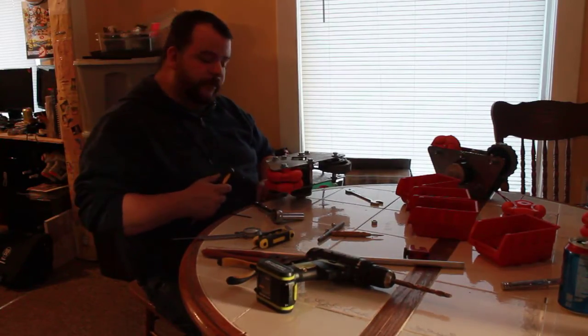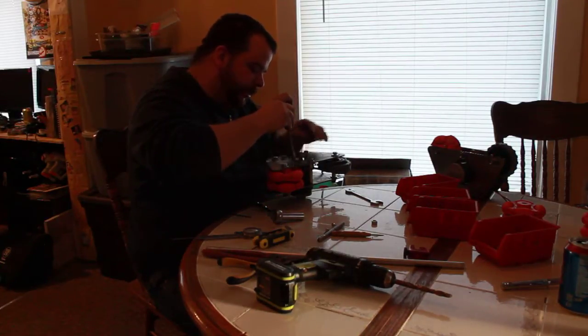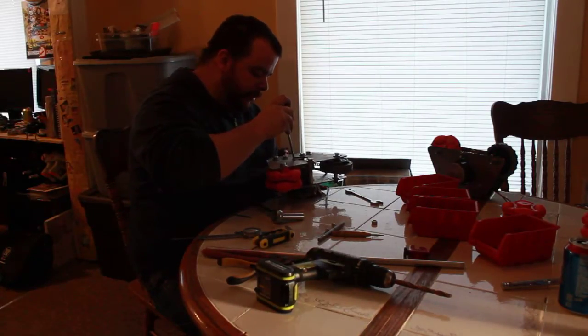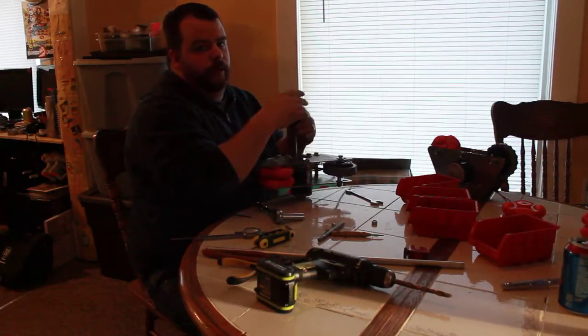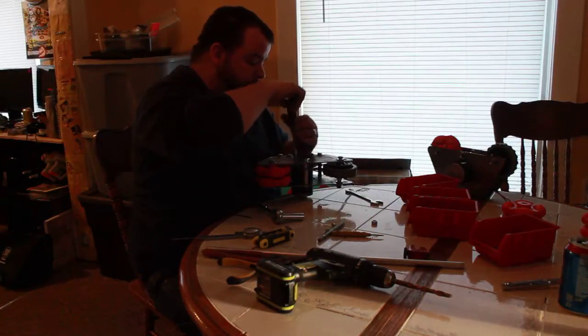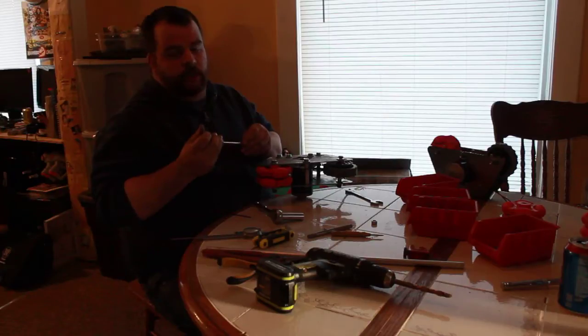My pan head screws are Phillips. My other ones were Allens. That's why I said you need an Allen wrench. I forgot that I switched it up. If you build these out of wood, the pan head screws wouldn't do really well. My wood version needed the pan head screws or the chain was going to hit the cap head.